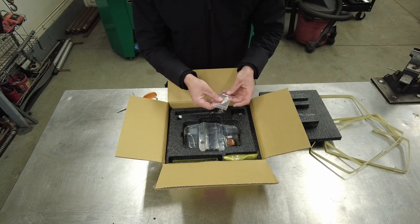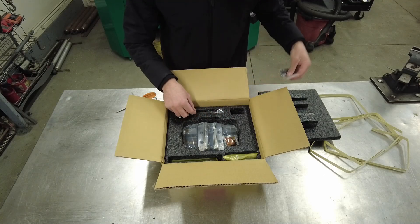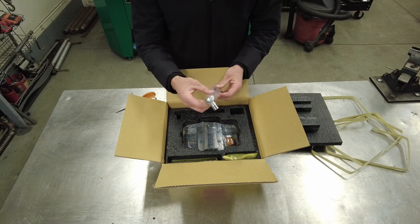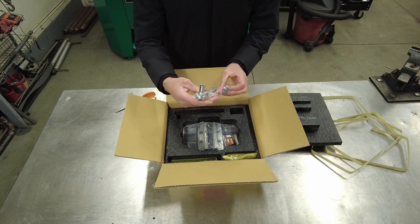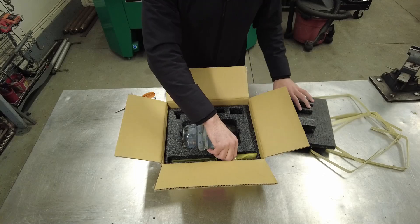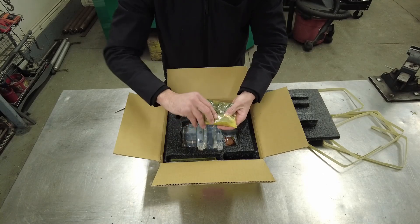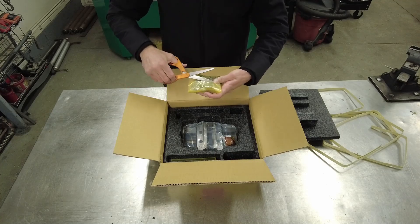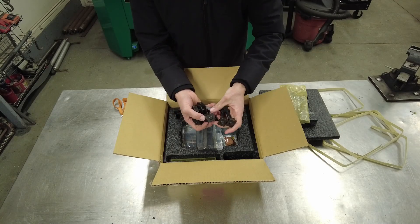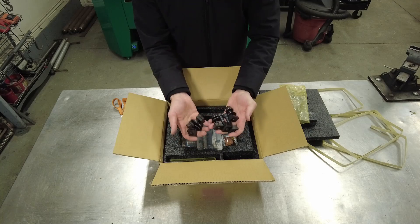Over here looks like we've got some centering studs, mounting keys — that's nice. Hardware. Check that out — a little ratchet. Doesn't look like it's a torque wrench, but it comes with a little ratchet and the right size socket: 12 millimeter socket, very nice. We have over here more mounting hardware, so T-slot nuts. Looks like a good amount of them actually — all different sizes, which is super nice because I've bought vices before that don't come with any of this stuff. Deep T-slot nuts, some shallower ones — six T-slot nuts, that's super nice.